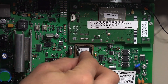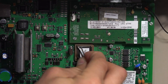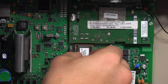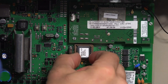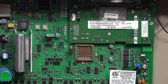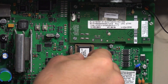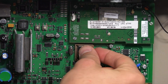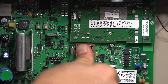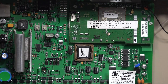After I do that, I'm going to go to the other side, insert it in this slot, and then pull up so it comes out in a uniform fashion. If you go back and forth, the PROM chip should come out nice and even. You just want to pull it out straight so that you don't damage any of the pins. After you have it removed, get your new PROM chip, put it square into the socket, and then press down with a uniform pressure. After you feel it securely in, you should be able to power your panel back up, and the firmware will be upgraded.